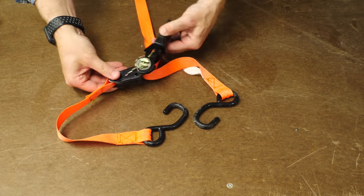Let's talk about a few of the types of clamps that you'll find out there. First, let's talk about band clamps. Basically, it's a strap with some sort of a ratchet at the end to be able to tighten it. These work great for clamping up things that are oddly shaped or maybe not square, but they're also kind of hard to handle.